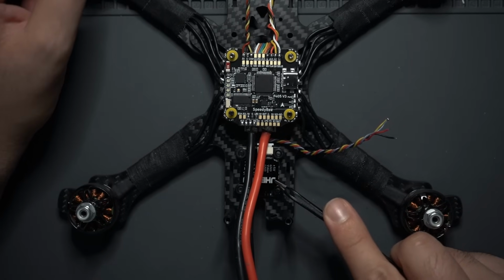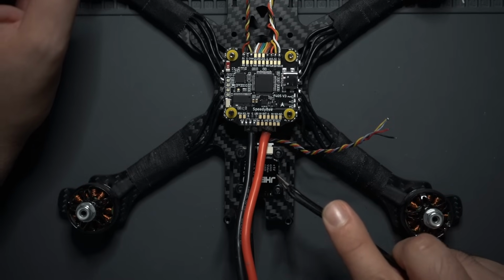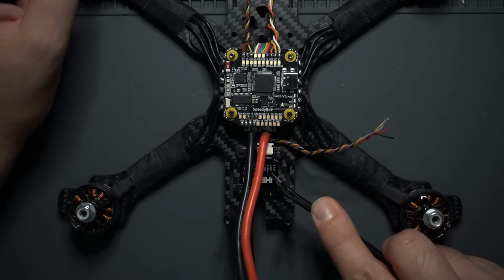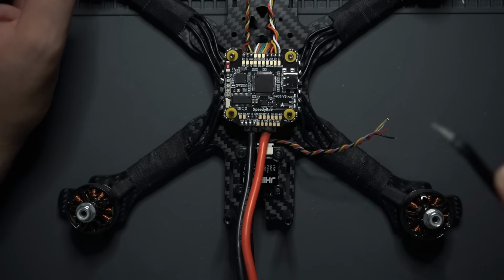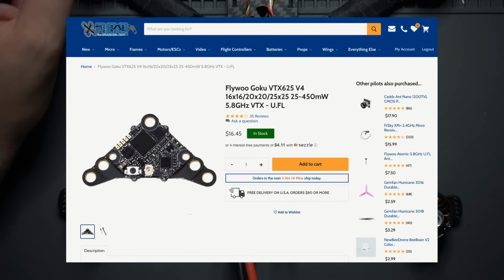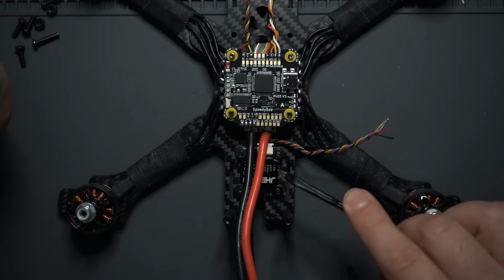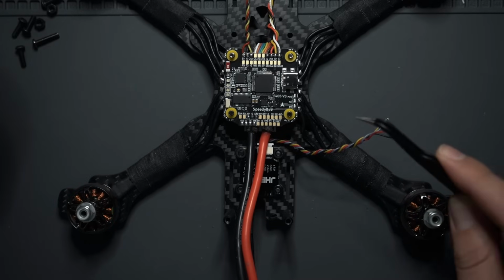All right, now it's time to hook up our VTX. I'm using the JHEMCU 600 milliwatt VTX. This one is capable of 7 to 26 volts of input power, but if you're using another VTX like the other one that I have recommended in the description, the Flywoo Goku 450 milliwatt VTX, this is a great alternative to this one. This one will probably get sold out. I feel like for 15 bucks, 600 milliwatts, this one's going to sell out quick.